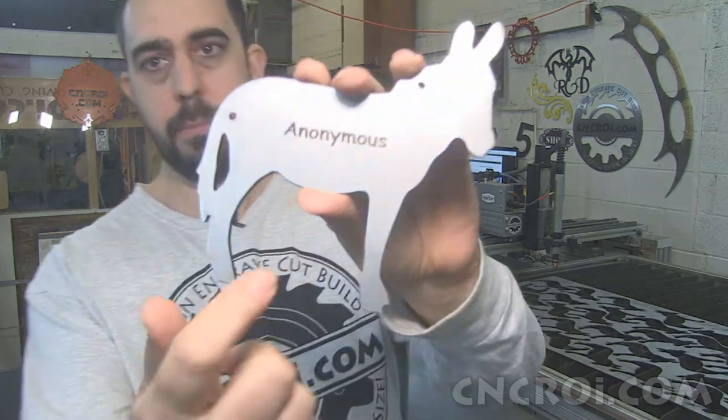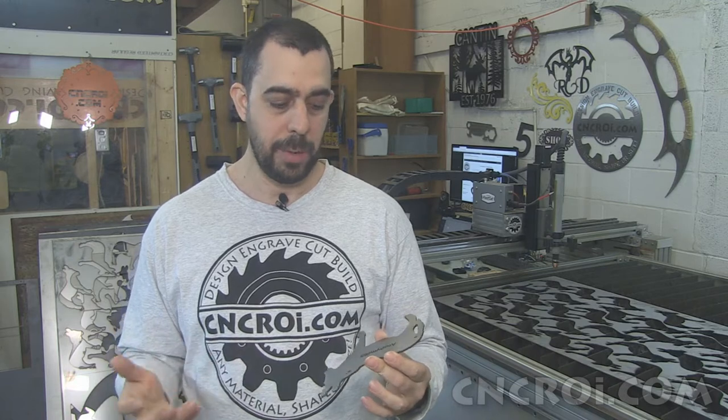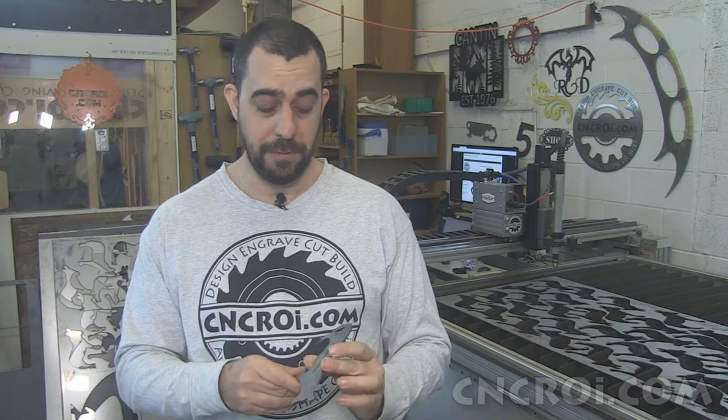And what you see here on the marking is actually fiber laser etching. The nice thing about fiber laser etching is it's permanent, meaning it won't fade, crack, peel, or come off, ever. I've actually had some jobs where I had to remove this because I screwed up, and let me tell you, it takes about half an hour with an angle grinder. It's not any fun, and you end up scrapping the whole piece anyways.